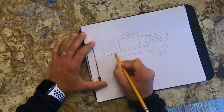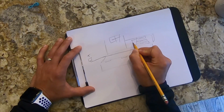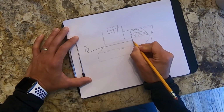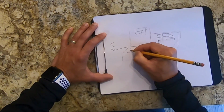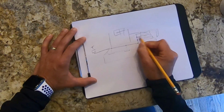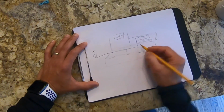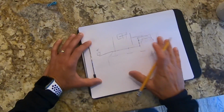So this is my main lead wire, and basically what you're going to do is junction or connect to this wire, and we're going to make these wires look this way, and another one here, another one here, and finally another one here. I'm going to use waterproof connectors here, and I'm basically just splicing my wire. So it's going to be one main wire that's going through my entire area, and then I'm going to plug into it, and I'll show you how I'm doing that outside.